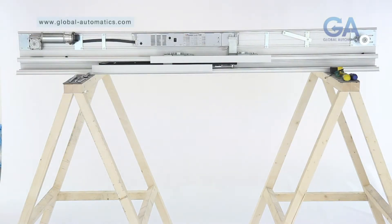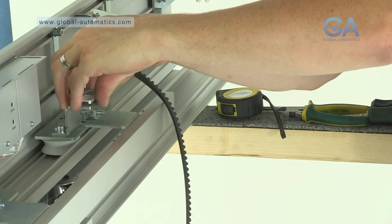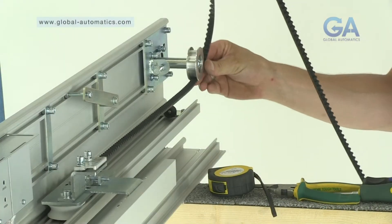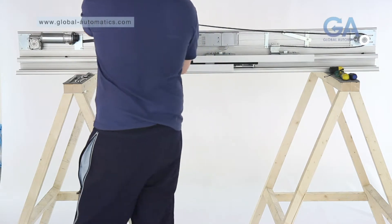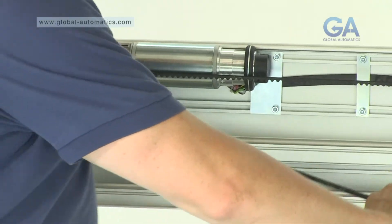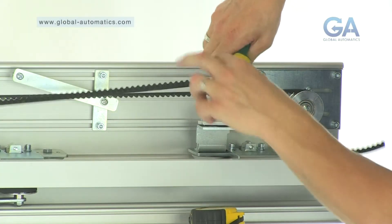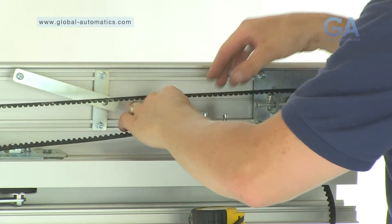Stage 13, fitting the belt bracket. One, insert the belt into the front carriage assembly belt clamp and temporarily secure the clamp. Two, wrap the belt around the idler pulley wheel. Three, guide the belt to the left hand side around the motor gearbox. Four, run the belt back to the belt clamp. Five, cut the belt to the appropriate size. Six, release the belt clamp and re-fix into position with both ends of the belt installed.